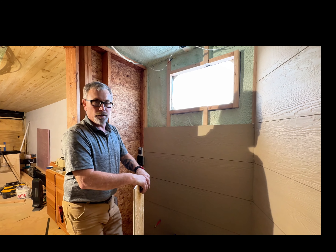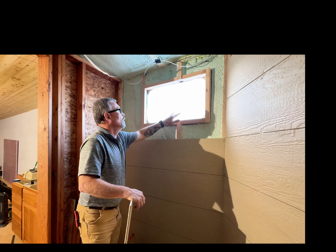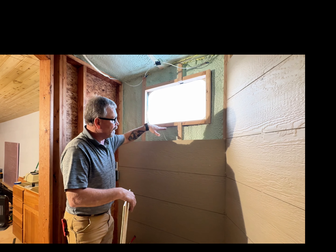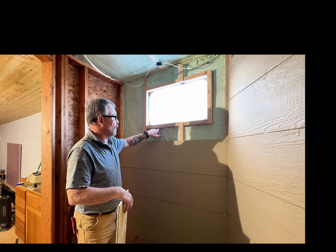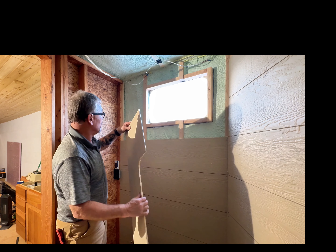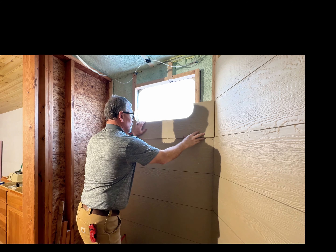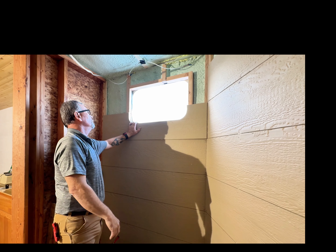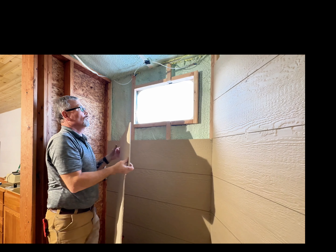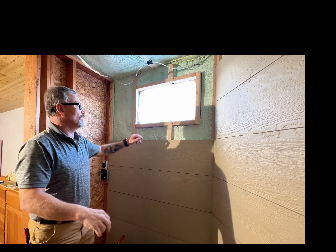So this is our first window cutting, and as you can see, once we cut through things we frame it back up so that it's solid. We made a template out there and cut everything from the outside first, came in, trimmed out our insulation, and we're going to go back in and put foam in here just like you would any door and window. We cut our internal pieces, do our adhesive and nailing of those, and they'll go back in there — that'll leave your inside ready to sandwich the window in, making sure it's solid so you don't have to worry about it moving and leaking later on.